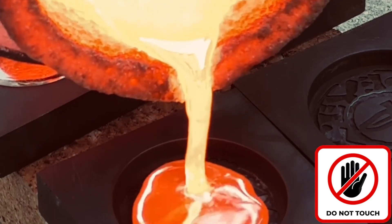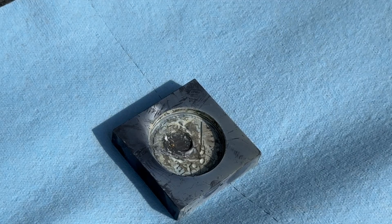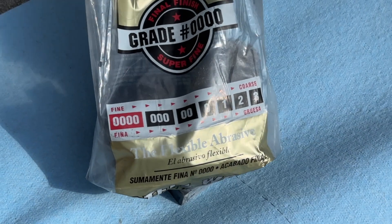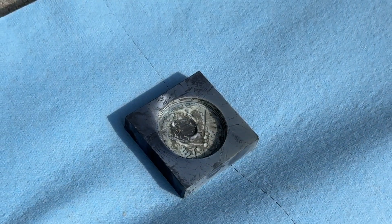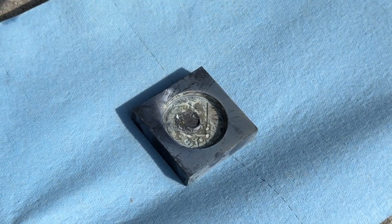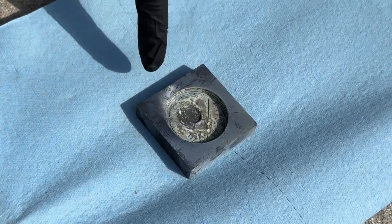This precaution is mandatory even if you are wearing heat-resistant gloves. Once cooled, you may periodically want to gently remove any casting residue with steel wool to restore the mold before your next casting session. This will ensure quality in your next castings. I do this primarily after casting with alloys containing zinc, such as brass, as they leave zinc oxide residue on the surface.